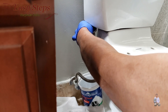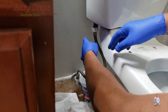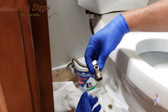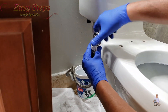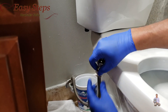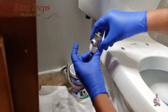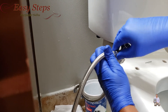As you can see it starts to leak out. We're going to make sure any water inside the hose is cleared. This is the one we need to install — the washer is provided. We're going to install the washer, then we're going to add the teflon tape on these sides. You do the same hand-tight, just like this.